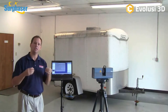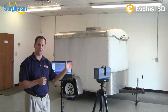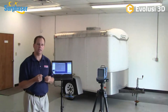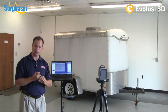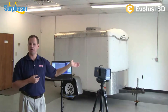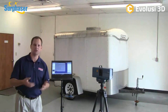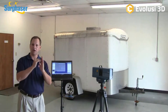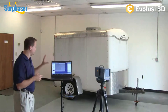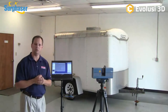Resolution is controlled by lines per degree — you take one degree and slice it up. This scanner works anywhere from 24 to 92 lines per degree, and what dictates that is how far away your object is and what point spacing or density you want. For example, if our trailer is 10 feet away and we want one-eighth inch spacing, the minimum of 24 lines per degree is probably fine. If our object is 50 feet away and we want one-eighth inch point spacing, we might need 50 or 60 lines per degree. The scanner comes with a chart to help you determine the right number based on distance and desired density.